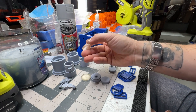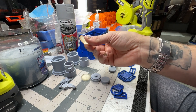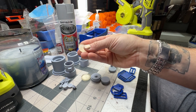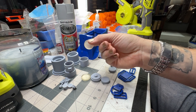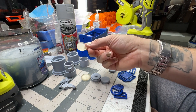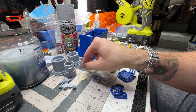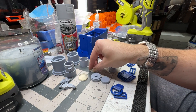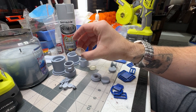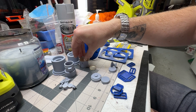You've got these two little discs. If you wet sand them with 800 grit and polish them, you can make them really, really clear. This is just how they come out when you first print them — they're kind of opaque, but you can make them really clear if you polish them. That's up to you; some people don't even put them in. You'll have to sand the edges again until it fits nice and snug.